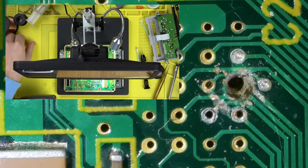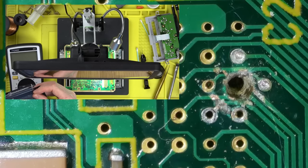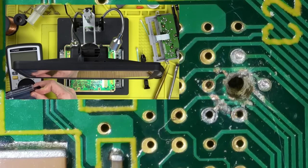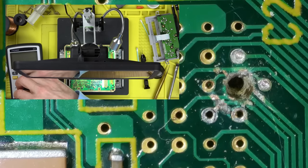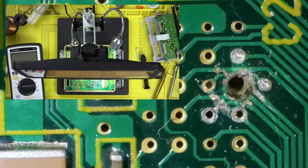If I'd known it was four layers from the beginning I wouldn't have drilled through — I would have taken off the heat sink and tried to get a wire just to the ball on the edge. But that's hindsight — I never knew. I'm going to get crucified in the comments section, maybe deservedly so. At least I've shown my errors — not everyone does.